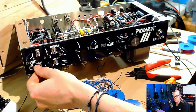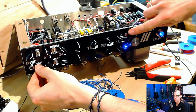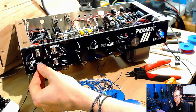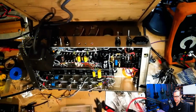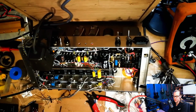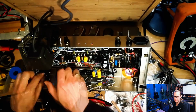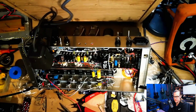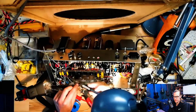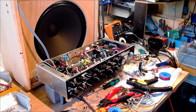And here you can see how I'm testing the channel switching relay function. So the amp is getting more and more functional. You can see the indicator light between lead and clean channel here. After that, on the left side, I'm working on the very first input parts. So I'm placing 1 or 2 resistors and connecting the very first 2 triodes. And here's a small jump in the time stretch video, but now you can hear some tunes hopefully in the next video. Okay, the first 2 triodes of the preamp are finished.